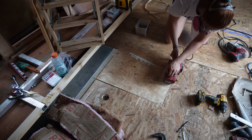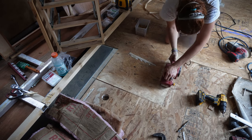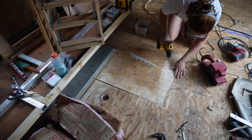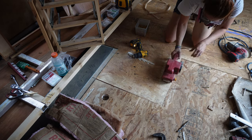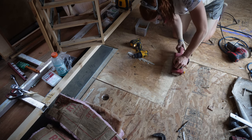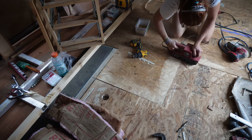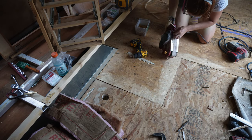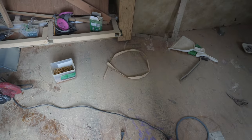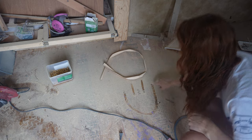And then I'm going to start on the floor. This is a handheld belt sander and I'm basically smoothing these two edges from the old wood to the new wood. I want it to be perfectly flush, so I'm going to smooth out this entire thing. I'm taking the screws out right there because it was grinding down on the screws and I didn't want to ruin the belt. That didn't matter because I ended up tearing the belt anyway, so I had to go get more belts - which was fine because this is actually my neighbor's and he was nice enough to let me borrow it. I just kept working at that until it was pretty smooth. This will create a lot of dust, so just watch out.